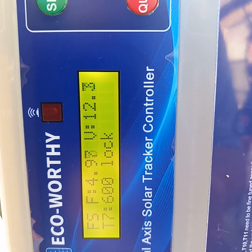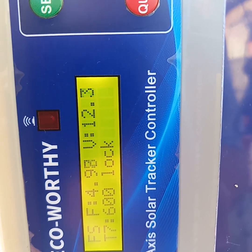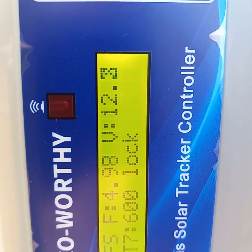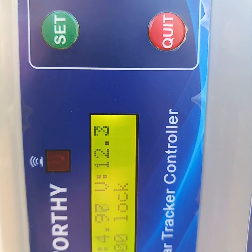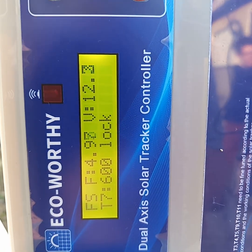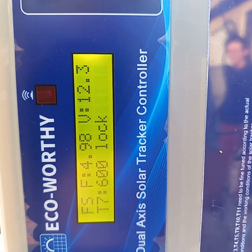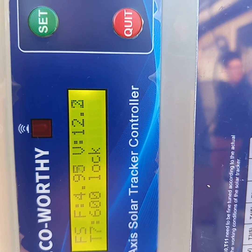Since it is extremely high, it is never going to function unless you go in there and change it. I do not recommend that at all because in extreme wind you'd have absolutely no protection. When I had the anemometer hooked up yesterday, I didn't seem to get any additional voltage — probably because it says it can only provide zero to two DC volts max, and that's what it's supposed to work off of. So it could never get this high on its own. I couldn't get it to trip even when I used a can of compressed air to speed it up. I think it just can't generate that much voltage. It's disconnected — do not use it in this mode if you've got any chance of wind, or you're going to end up with something destroyed.